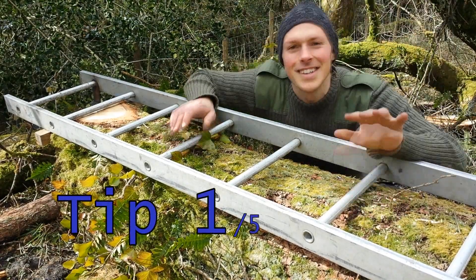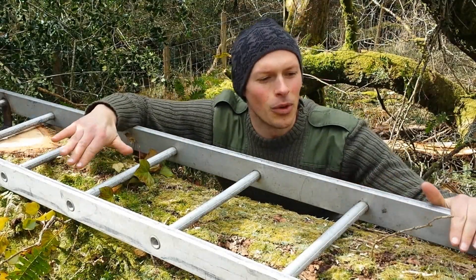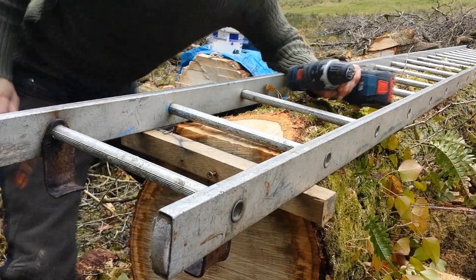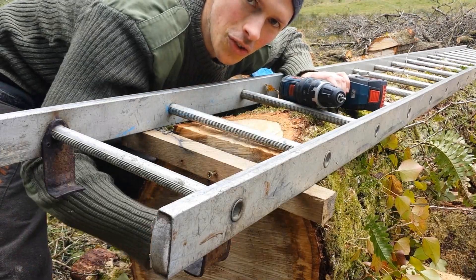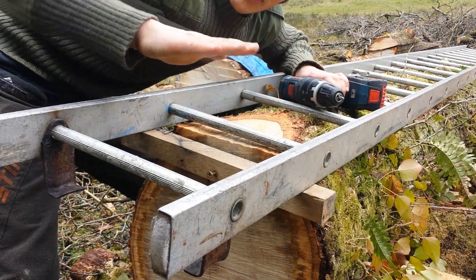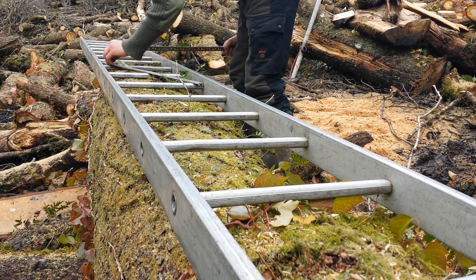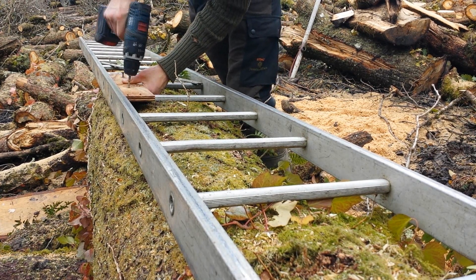Tip number one: spend a really good time setting up the first straight edge. It's hard to go back if you get a wonky first cut, and it's much better to spend the time now getting everything completely sorted and solid. So at this end, this piece is screwed onto the ladder which is in turn just screwed through into the end of the log. That works pretty well for getting it locked there, and then it's just a question of locking it along the length. To save butchering the ladder too much, I just use these metal bars and a little bit of plywood and screw through that, clamping the ladder to the log.